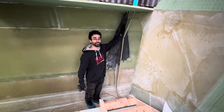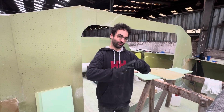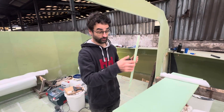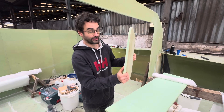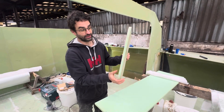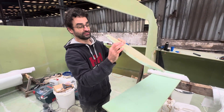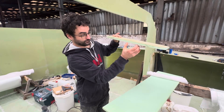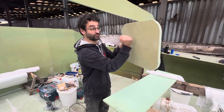For a general panel without load from one specific direction, we use biaxial — it's strong in all directions. Here's an example of a finished panel incorporating all the materials: we have the foam core, and on each side two layers of fiberglass, making the sandwich panel. This gets impregnated with epoxy and bonded together under vacuum so everything is perfectly joined. That makes it really light, stiff, and strong. The reason it's so strong is that when you try to bend it, one skin goes into compression and the other into tension — it's like an I-beam in principle.